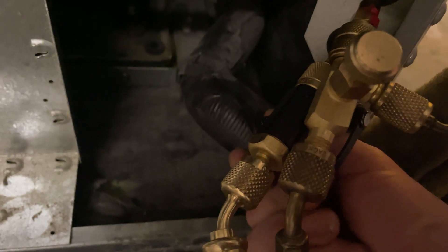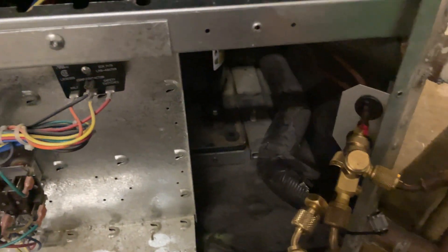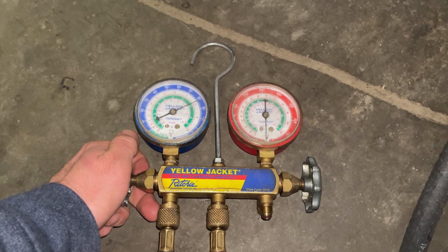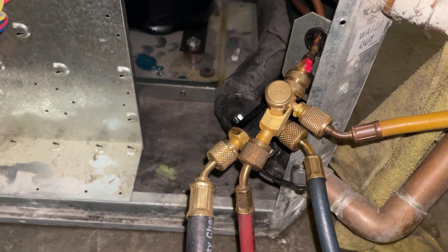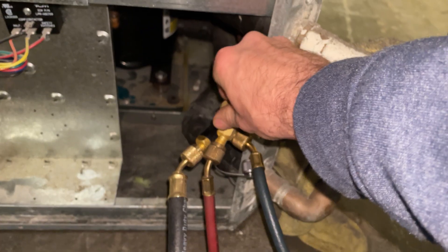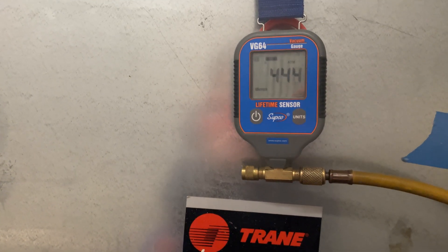Closing down on the liquid port, closing down on the suction port, shut it off right here. Then I'm going to check the rise on my micron gauge — we're at 975 microns. Been about 30 minutes. I'm going to go ahead and break this vacuum. I'm going to vent it and then turn my vacuum pump on after I broke it with just a tad bit of nitrogen — that's just to get any droplets of moisture that are still in there, because it did rise about 400 microns over 30 minutes. I'm going to open these valves back up and let it vacuum a little bit longer. This is going to be the second sweep — below 500 microns again.